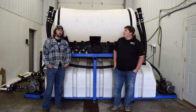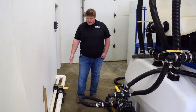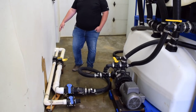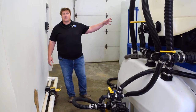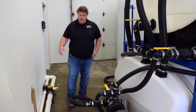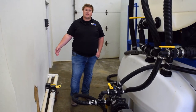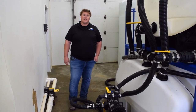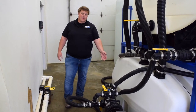Let's take a walk around this brine maker and show you how we have it plumbed in. Here we have the guts of the system — a three-inch line for salt brine and a two-inch line for calcium chloride. It all plumbs into our brine maker, which is not only your brine maker but also your central fill station. We're using the same pumps for agitation and to fill all our trucks — no separate pump needed. We're in a heated wash bay, but either way the efficiency and reliability of electric pumps is great.